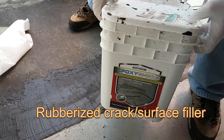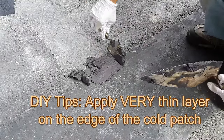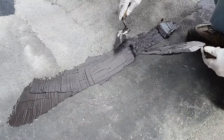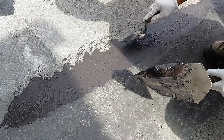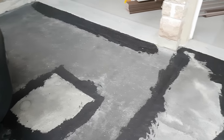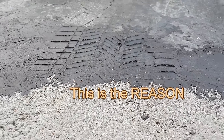30 days have passed. Now I'm using this rubberized product to make the edge smooth. I hope it would create a good transition between the old and new asphalt. This looks really ugly and your neighbors will be wondering if your DIY project has failed. This is the reason why I told you not to apply the rubberized product to the main repaired area.